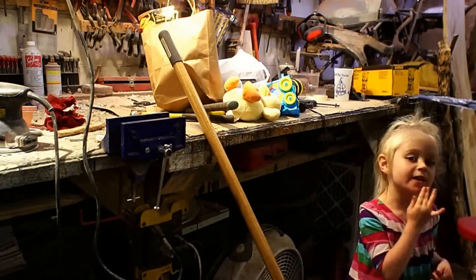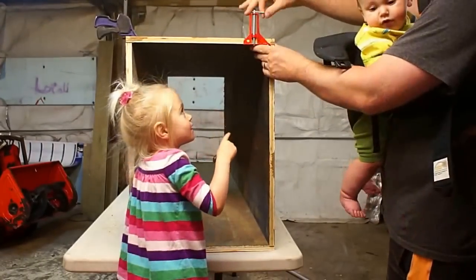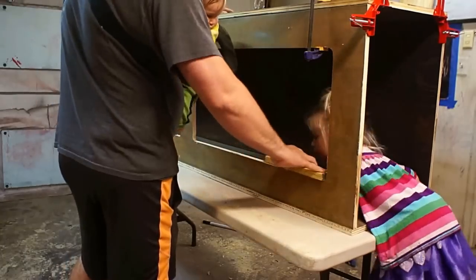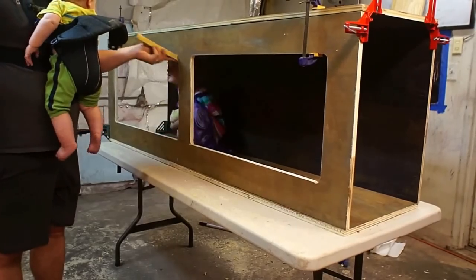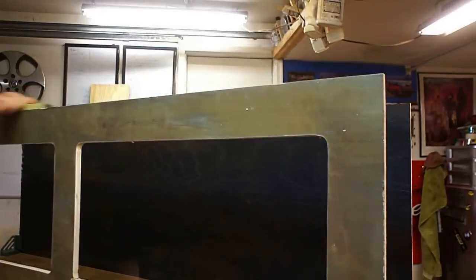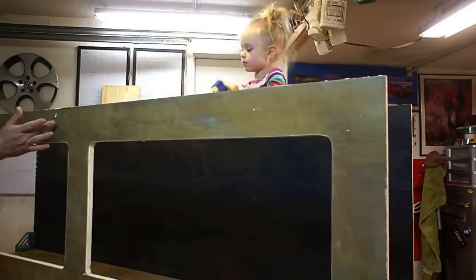With all the major cutting done, it was time to move on to assembly. These things are corner end clamps — they're pretty cool and real cheap, about three or four bucks at Harbor Freight. Stick them on there, mock everything up, and you don't have to worry about everything tipping over or needing two people around. I'm going through here cleaning up some of the openings, making those radiuses match the lines and smoothing everything out, making sure there are no ridges that'll interfere with assembly and throw things off square. I always hit it with a little bit of sandpaper before the glue-up.